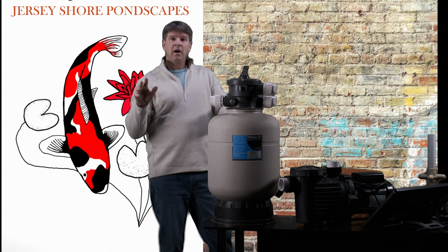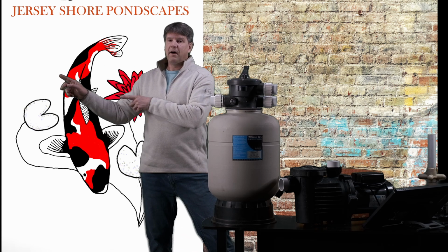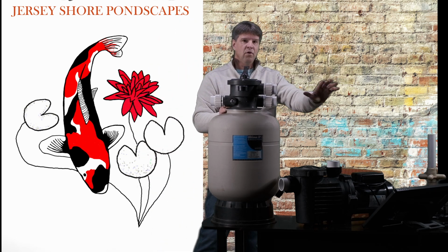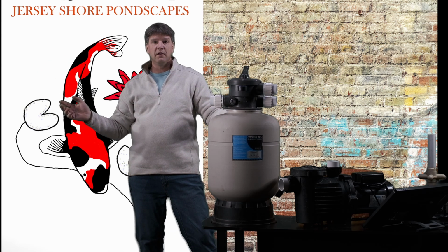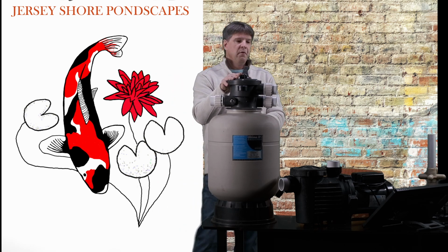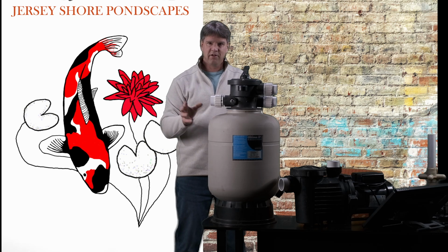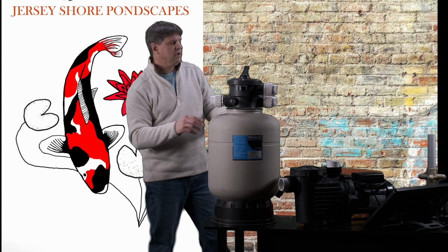Just keep in mind that when you backwash, we're draining water from the pond, okay? So if you do it more often, you'll need less water to clean it, right? You're going to put it on, let it run for a minute or two, and then it'll be good, okay? If you don't clean these things often, when you go to backwash, you may have to run 10 minutes and drain a quarter of your pond by the time this starts coming out clear, and hope that all that sediment in there is coming out, okay?